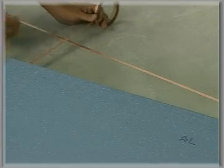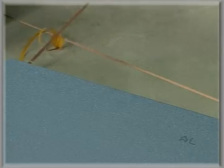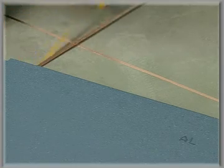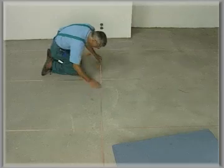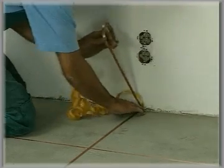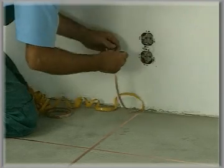Installing to be electrically conductive. When you're installing Norament AL and EL floorings, you must install a copper tape under each row of tiles. In rooms smaller than 40 square meters, it is sufficient to have one cross connection leading to the predefined equipotential bonding feature, which must be expertly connected by a qualified electrician.